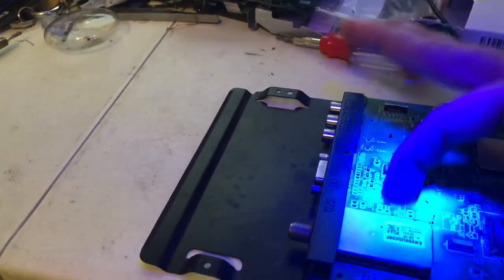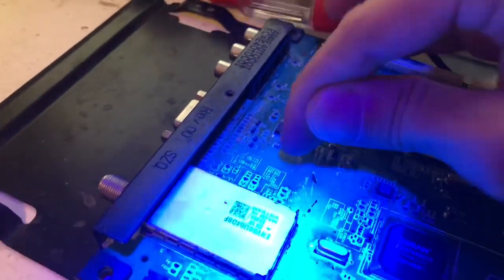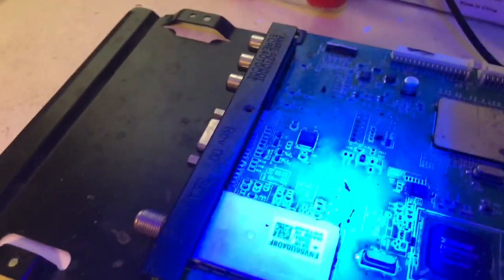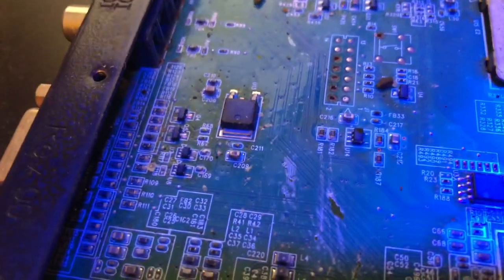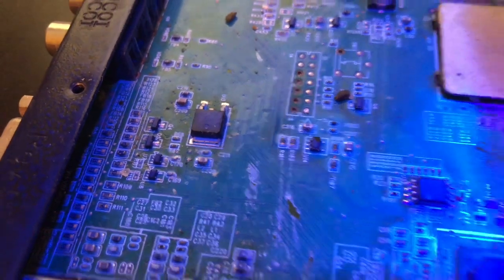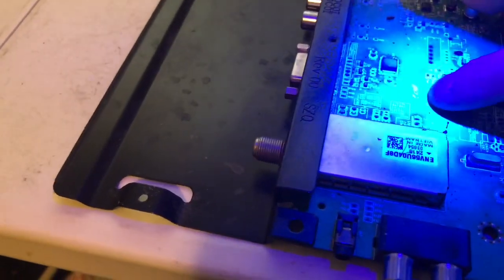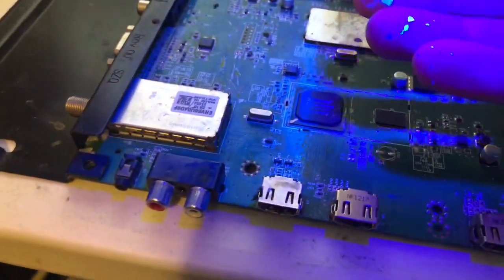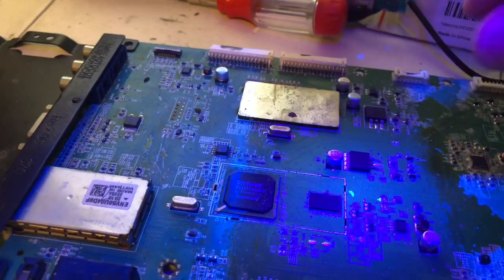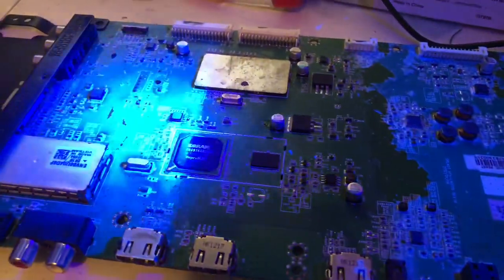So in this video you can clearly see which is far superior — the silicone versus the acrylic conformal coating. The silicone requires significant force to even scuff it while the acrylic flakes away easily, especially once moisture gets underneath. The silicone is still protected even after all these tests. Thanks for watching — I hope you enjoyed this video. I finally got the chance to do this test. Please consider subscribing and I'll see you next time.